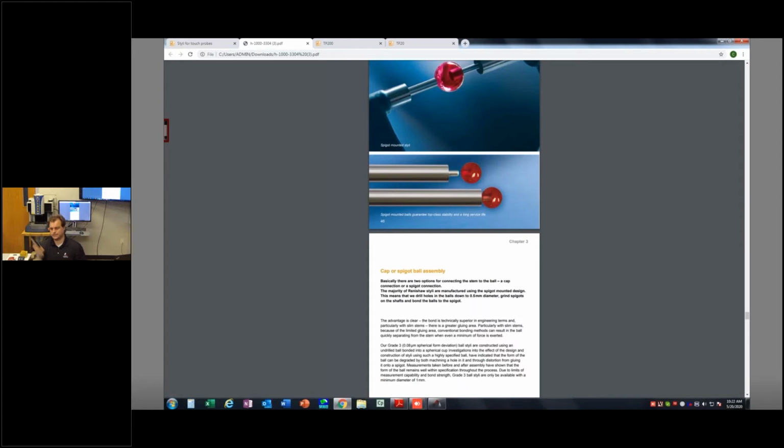So good for the single probes, okay. Well, not so much fun with the star probes, because it's going to get this one nicely and this one nicely, but then when I get over here, I've got this stem to deal with that's going to kind of maybe argue with my number 1 probe there. So something to take into consideration. If you're going to be doing a lot of star probing, I recommend something like that, where you have your probes oriented positive 90 elevation angle, and that way I'm never having to deal with this stem getting in the way of anything.